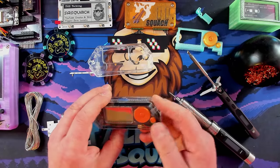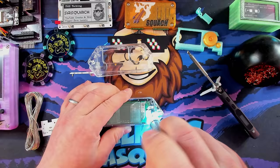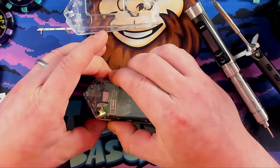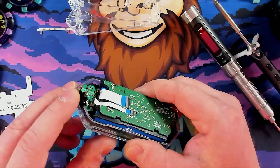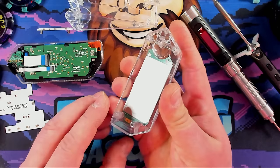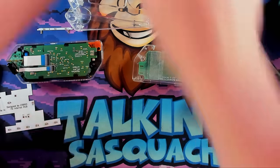Let's power this down and take it apart. It's held together with four screws and I'm using a PH00. That works really well — I haven't stripped anything, so 00 is my favorite. The important part: you want to lift this straight up, as straight as humanly possible. Make sure you've got all those screws all the way out, because you don't want to break your pogo pins. The pogo pins are these three little pins right here — they're extremely easy to break off. I'm also going to remove the NFC board and screws.